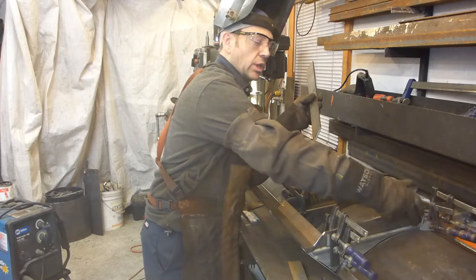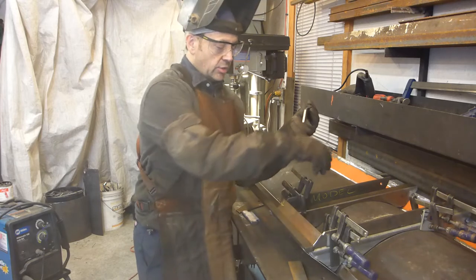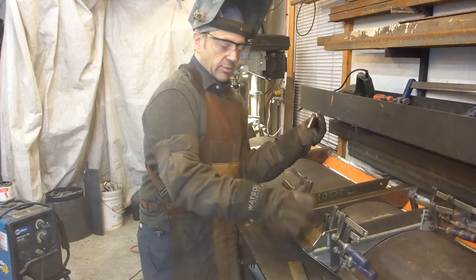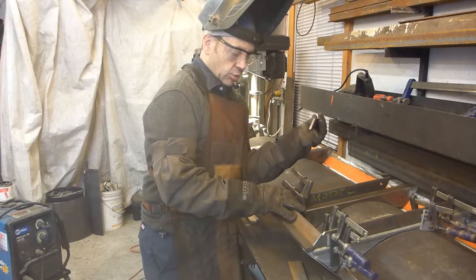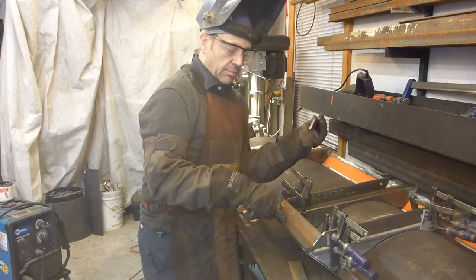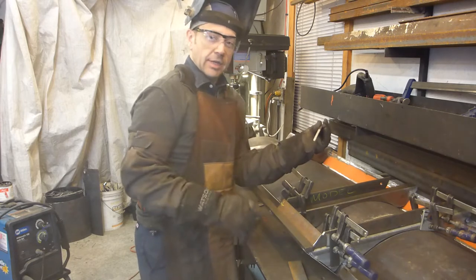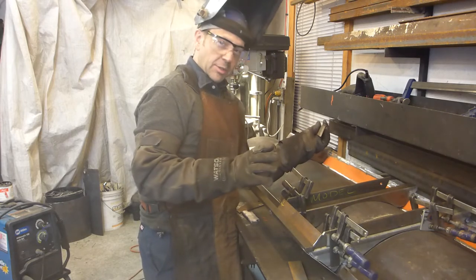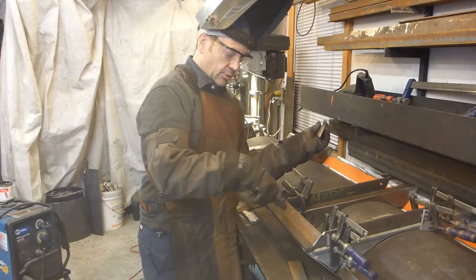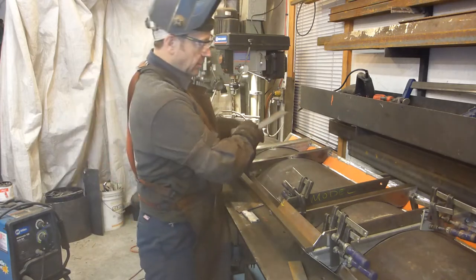So we have some good welding on the side. And then we have that plate that goes on the top. So we've used that model to make sure that we have the same angle from one side to the other side, so we have a proper setup to be able to weld. We're going to weld here on that flat bar on the sides, and a little bit here and there inside. Not this one. And Dave, you're responsible to check me, make sure that I don't weld those two pieces together. Only a support. And we're going to repeat, obviously, on the other side.